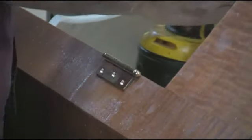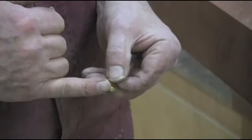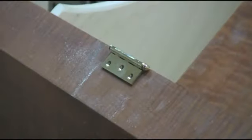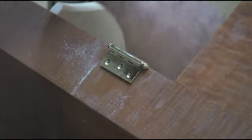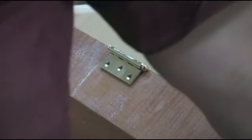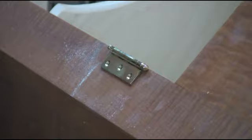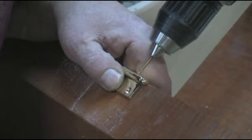Why? Take a look at that brass screw. There's a little heavy area right here at the head of it. Just helps it go in easier, set better. Now one of the other things is usually some of them call these VIX bits, snappy bits. Typically they don't drill deep enough for a 3/4 screw, and that's what these are. That same little bit that you use to drill for them toothpicks, make your hole a little deeper.